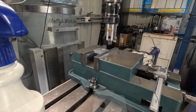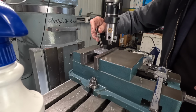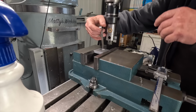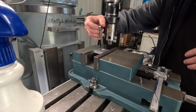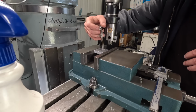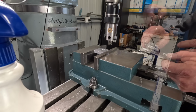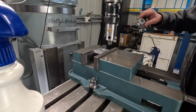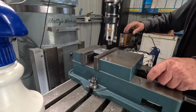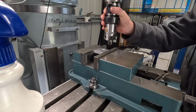Okay, I've started putting this bore in. And no real easy way of measuring it, really. So, I'm still learning how to drive these. Trying to get the feel for them. This has to be out to 15.5, 2mm deep. 14.4. We're at 14.42.